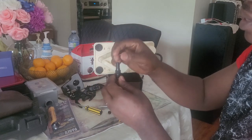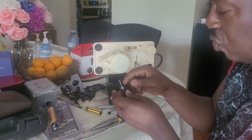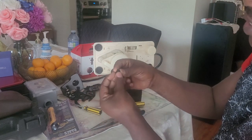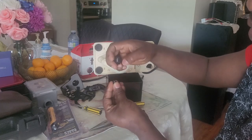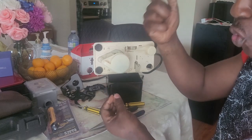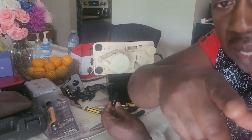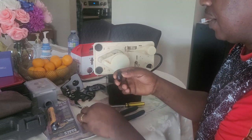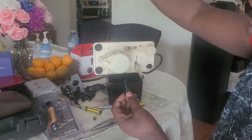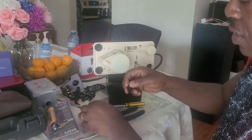What happens is sometimes when it keeps on running for years, a lot of dirt goes inside. The ball is supposed to sit here. So when the pump starts to pump, it lifts up the ball to float, and then the water goes outside. After it stops pumping and empties the tank, some of the water wants to return into the pump. So it pushes the ball with pressure, and then the ball comes and sits here.